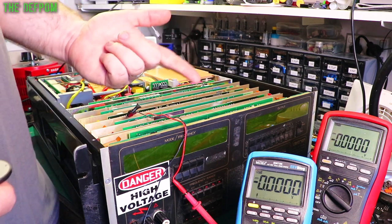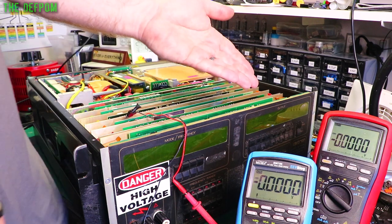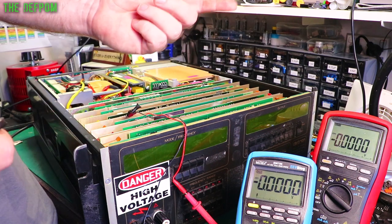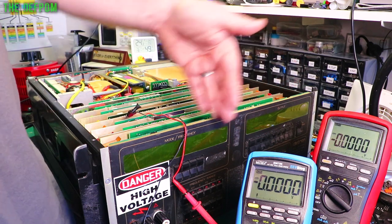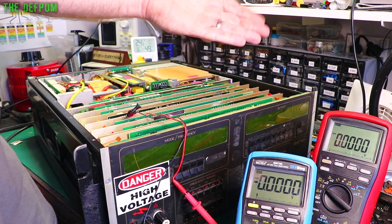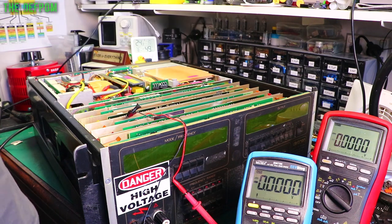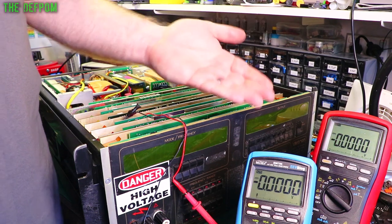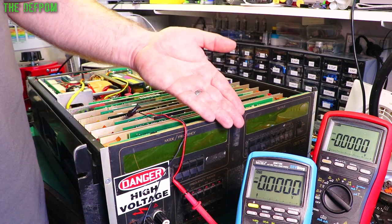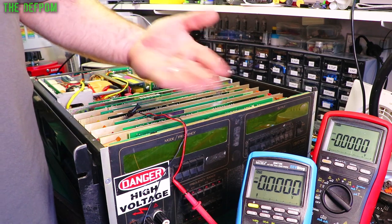The error I'm getting is at fail 2, which is an overvoltage thing. Now when we're doing normal testing on this, it only comes up in the high voltage settings, if I do a self-test as well. But if I'm doing low voltage stuff, below 100 volts, in like the 10 volt scale and downwards, then I'm just getting a voltage error on both DC and AC, as we saw. If you think about this, the offset of the voltage being 6% higher, whatever it is, could potentially trigger the overvoltage error in the higher ranges, because it is overvoltage.